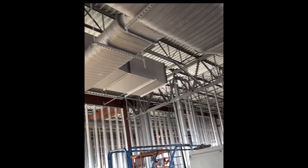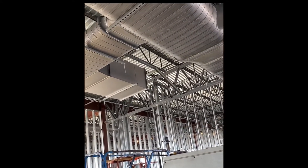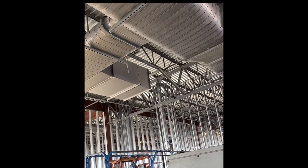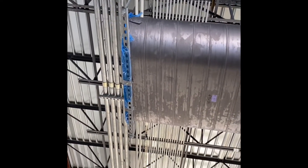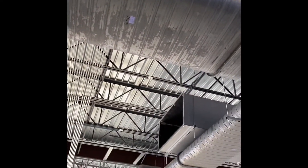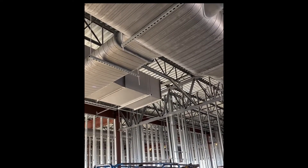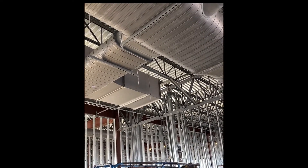Well, we've got a couple of options. What we might do there is split it out and make two — like a pants leg. We'll take our square inches of the duct and run two smaller ducts to pass through, then do the same thing on the other side. We're just going to get it run at a certain point, then I'll call a meeting.